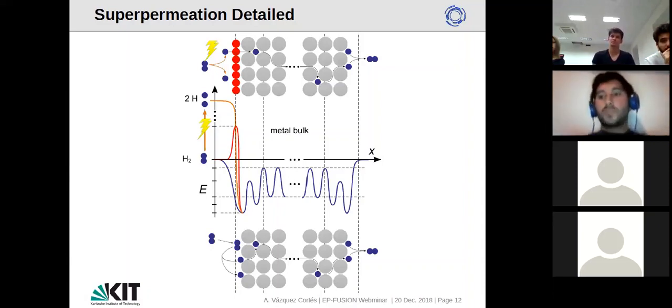Actually, during my interview for the EEG at Garching, they asked me if this technology, the metal foil pump, could be used and tested in ITER. Mainly because it's interesting, but also because I've heard people from ITER are not sure whether they could handle all the tritium that they need to handle. Including this DIR concept, even in a very novel configuration, will reduce the tritium inventory. Therefore, it could be tested.